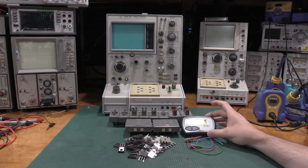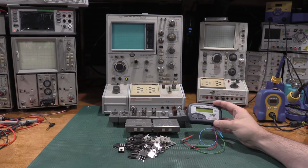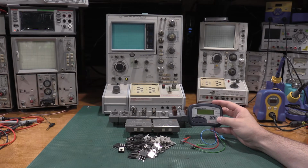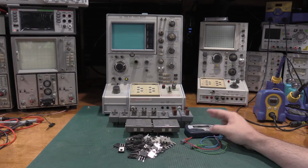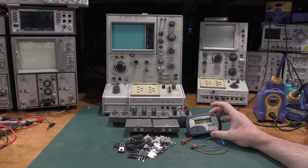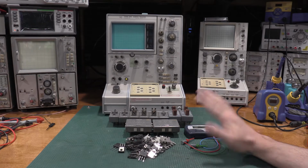Because this is the Pro, this is actually a curve tracer as well. However, it needs a computer to do that. A couple of the more rare transistors that I needed for the 5200A, primarily the 2N4888, if I remember correctly, I actually have 8 of those that are original equipment. I ran this and stored the curves in the software on the computer, so I have some records if I ever have to match and source new transistors. So the ability for this thing to save and call up curve graphs is, in my mind, really powerful.